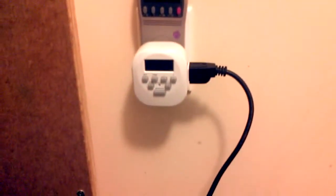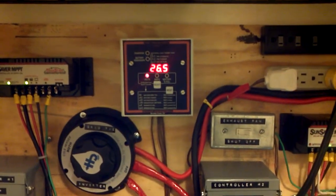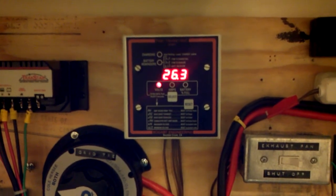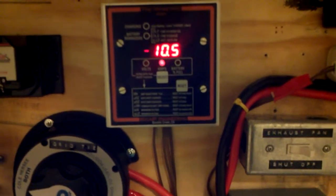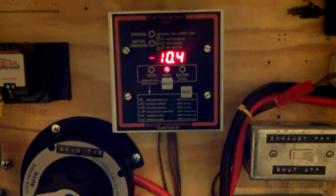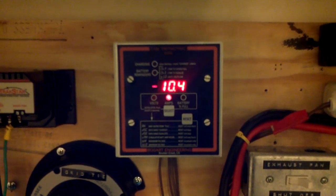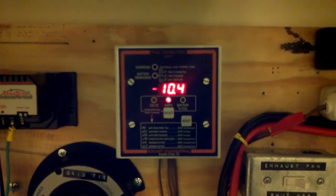It's now on, it just started. The voltage went down to under load — it just went down to 26.4. It's 8:41 on a mostly sunny day, and it's now drawing about 10.4 amps out of the battery bank.